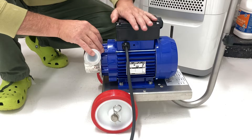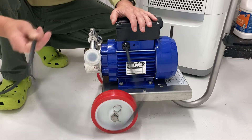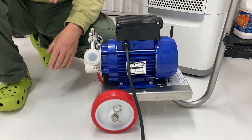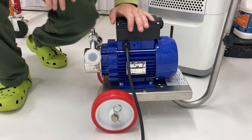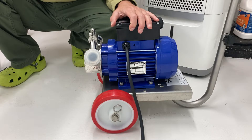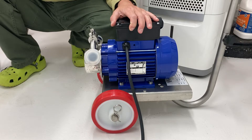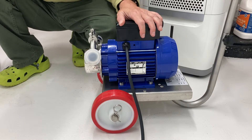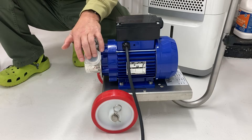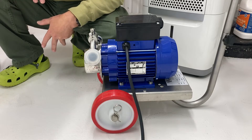As I mentioned, it's a 240-volt pump. It does not come with a very long cord — in fact, the cord is really not long enough for much of anything — but you can buy cordage and put a new cord on yourself, which I did. My cord is 25 feet long, so it's long enough to go from the outlet into the main aisle. If I wanted to move juice from a 55-gallon drum and pump it in here, I can get the pump as close as I can to the drum. Remember, you never restrict the inlet of a pump, and then it can push through whatever size hose I have into the receiving container.